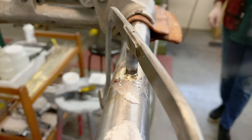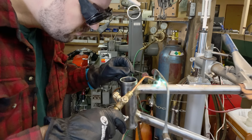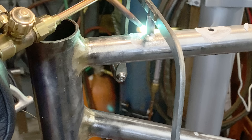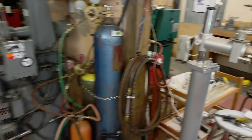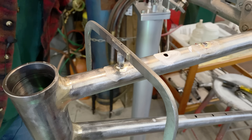See if you can get it so the silver doesn't flow out much at all. You got a big blob on the end — that's a little big. You need to heat up the metal first. That was a big ball you had on there. You don't need to add any more metal if you can flow that all around, but you've got way too much on there. You're basically saving it by running it all around.